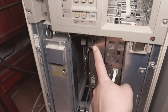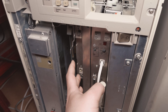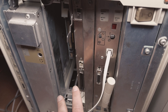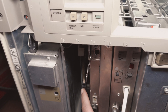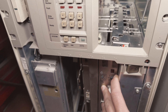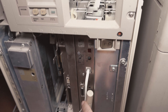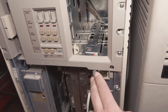There is a QBus card and I don't know what it is. I got this machine from a university, and maybe it's some kind of imaging hardware — this looks like a terminal port and this looks like a SCSI port, but maybe it's something completely different. There is also a SCSI card, because I want to install VMS on a SCSI device which I will add soon. The SCSI card originally from the right machine is in there for testing purposes, and it's also connected via 10Base-2 to my home network. Let's turn it on.